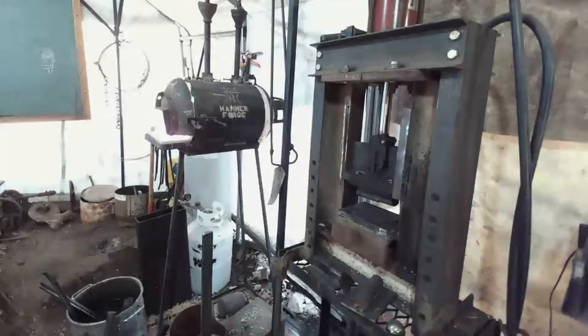I should have rebuilt Fred in December. It's better, for one, clean insulation, clean bricks. And, you know, the ability to do the quick change on the flares now. I'm so glad that Justin finally convinced me that this was the way to go. And it truly is, having that quick change for your flares. It saves so much time. I mean, it's what, probably 15 minutes versus 4 hours.